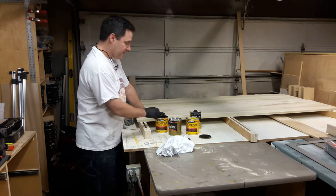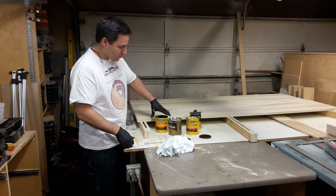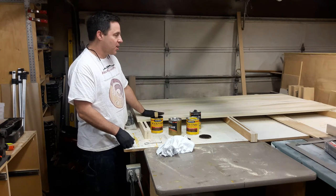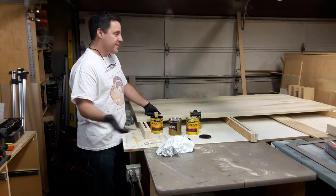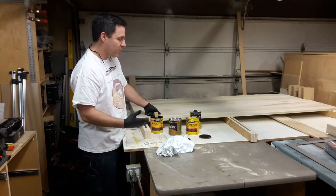At a fraction of the price. Anyway, the finishing schedule on this one: dark walnut is going to be the first coat, and then that's going to dry 24 hours. We do that so that if you wipe on any second coat, it's not going to pull up the first coat with it — so I want it to dry a full 24 hours.